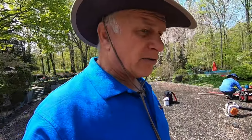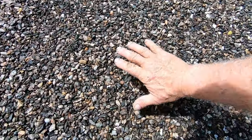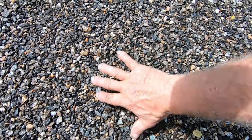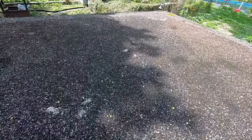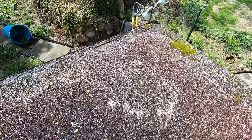A gravel roof — I will not repair it if there were blisters on it. A blister is something that bubbles up. You will see this heaves up and there's air underneath the bubble. I don't see any blisters on this roof — no blisters at all. So I feel this roof is in fairly good condition.